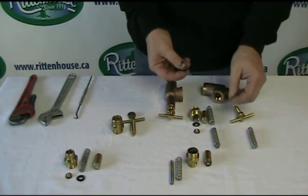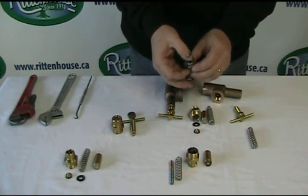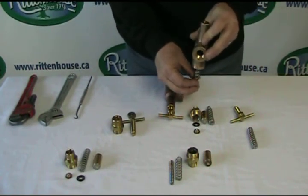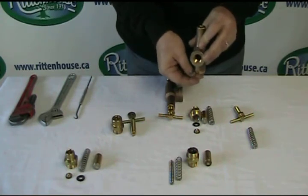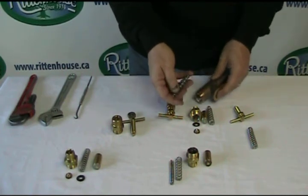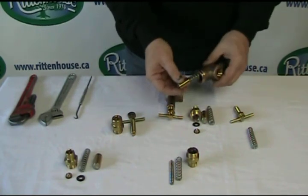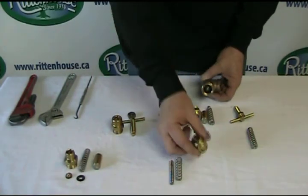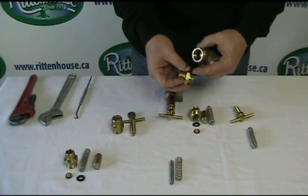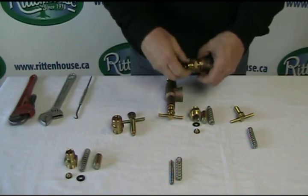Now to put this back up inside, I find it quite easy if you take the springs that you're going to replace, set that on top like so, take the body of the regulator, pull it over top, and push up inside until you have it seated. Then you take the top seat, put the springs inside the cup of it, and slide that up inside. Take the bottom seat — note the threads on here, you do not need to tape this. Once you get it on and get it tight, it does seal up on its own. No tape is required on that part.